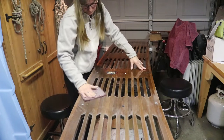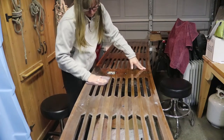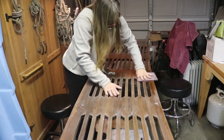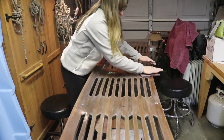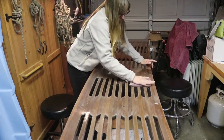Between every layer, I'm using a Brillo pad to sand down the surface and make sure it's bonding all the way to the wood. The Brillo pad will smooth it out between each layer and pop any of those bubbles that we missed. Anywhere that the varnish didn't completely bond, this should break it up so that we can fill those pores on the next round. It works really well, but sometimes you've got to put a little elbow grease into it.